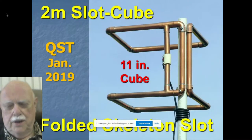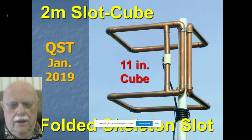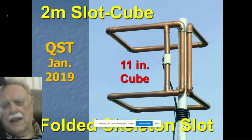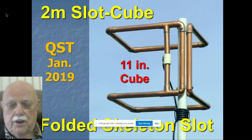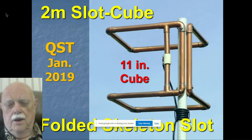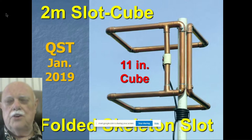As a side issue here, just to show you this one. Here's a skeleton slot. Here's the antenna that's been folded. I ran this article in January 2019 as the cube slot. As you can see, if you just unfold that cube and flatten it out, it's just an antenna. It's a folded skeleton slot. But I already knew you can fold slots, so why not? Here's a little 11-inch cube that has the same performance as a 5-foot tall, the famous copper J-pole for 2 meters. Which one is your neighbor going to notice?